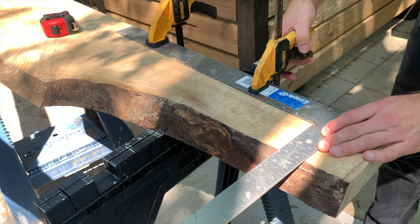I'm starting to take my live edge lumber and lay it out on a 4x8 melamine sheet to get an idea of how I want to build the form. After determining the final length and width of each coffee table based on the epoxy river width, I marked the melamine form to match those dimensions and used a straight edge, clamps, and a circular saw to cut a perfectly straight line. A track saw or table saw would make this easier, but sometimes you have to improvise. After cutting out the base, I ripped three-and-a-half-inch boards for the sides of the form and cut them to the appropriate length.